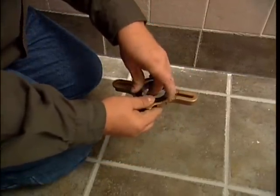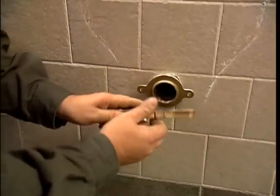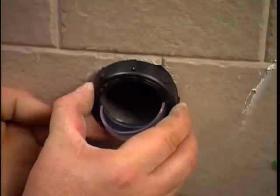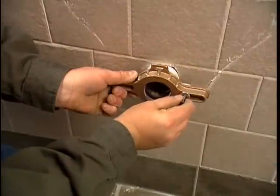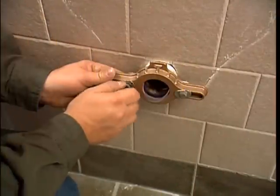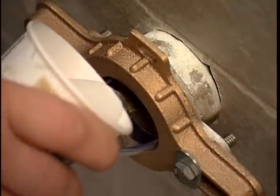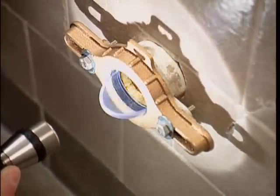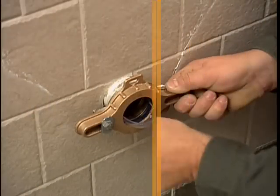Install the brass retainer flange that came with the Waterfree urinal. Be sure the gasket seal and clear plastic inspection disc are in place to check the pitch on the nipple. If the nipple has no flange, thread the included 2-inch nut on the nipple with the inspection disc in place. Slowly pour a small amount of water into the drain. Use a flashlight to check the pitch of the drain. There should be no water present in the inspection disc or nipple. Remove the flange after inspection.